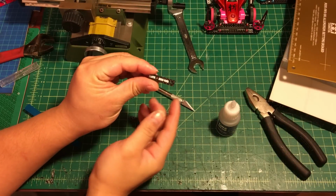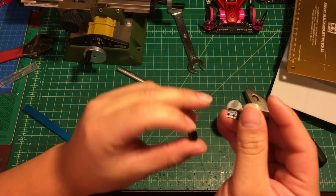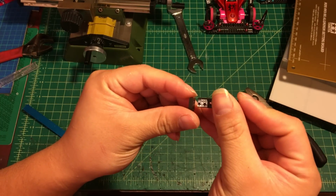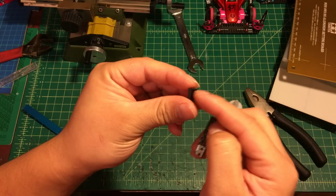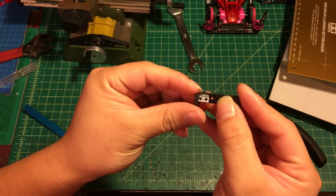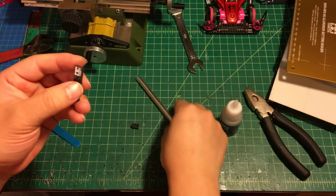Okay, moving to the next, we're going to cut a latch. That latch has to fit into the notch later, like this. It's going to be 3 millimeters deep, so you can insert it into this piece, the base, all the way like this. So the result is going to look like this. Okay, so here's my dimension.